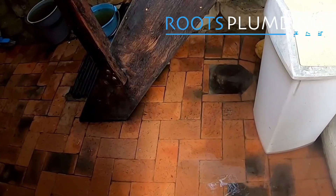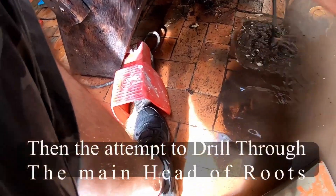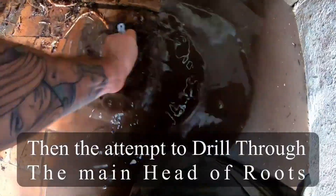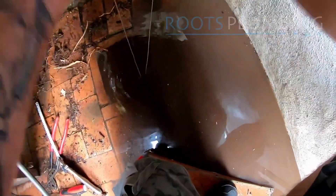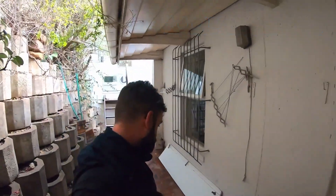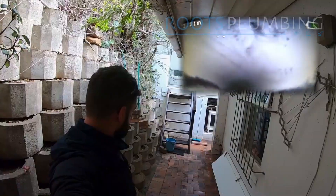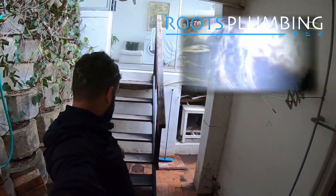This is one of the more challenging blockages that I've seen. Evidently roots growing into here, so I think we're going to move over. This is where I started out earlier — this whole area was covered in water. This is the top of the drain line; it's going down in that direction and then in the corner it changes direction and we have another rodding eye over here.